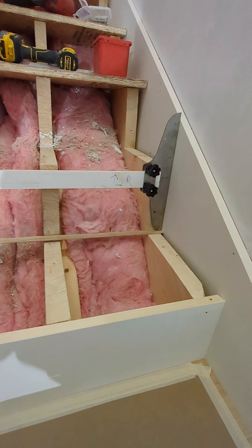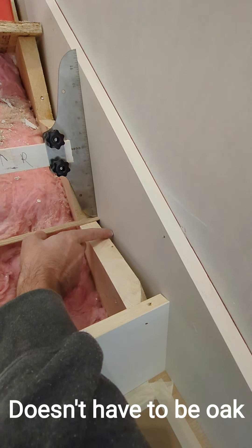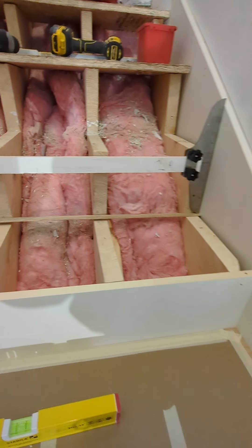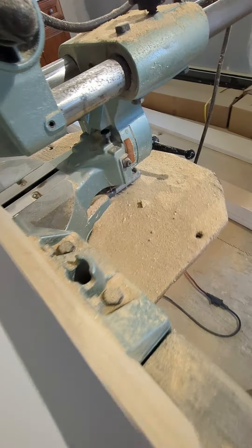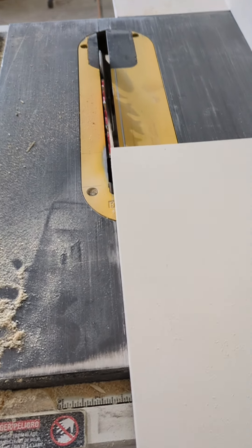What I've been doing for the kicks: I have this thin strip of oak ripped because my gauges would fall into the gap, which would probably be fine, but I'd rather not. This is going to give me a better reference. I just lay the gauge onto my kick stock and knife my marks for accuracy. Then we'll just cut our scribes on five degrees.